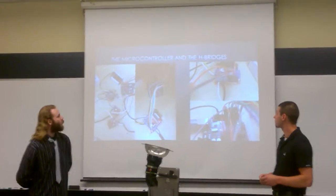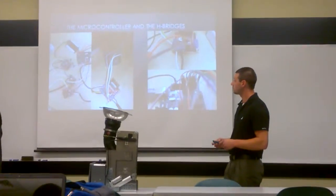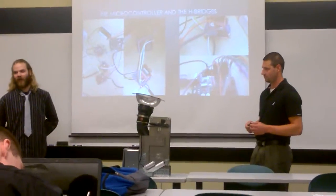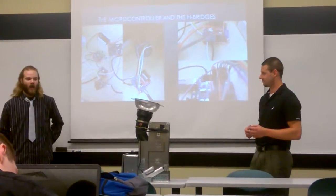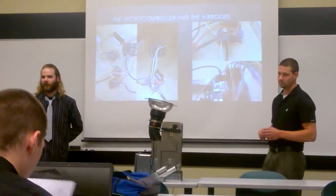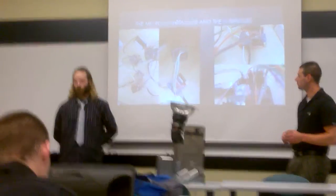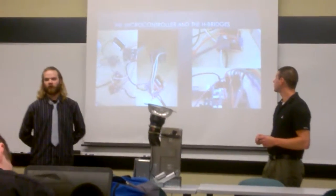This is our board that we ended up using — the Arduino Uno microprocessor — and several H-bridges. We could have condensed this down to two, but we kept blowing diodes on our H-bridges, so we ended up with three. The first time, we blew out one of the H-bridges because we had a jumper wire left in place and sank way too much current into it. The second and third times, our solenoid had too much kickback, and we had to come up with a mechanical isolator to keep it from kicking back to our diodes.